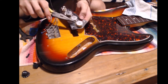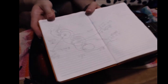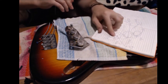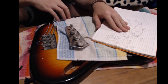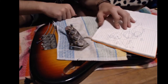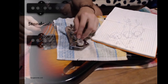Solder those to there, and also we're going to put our ground connections through here as well. Always make sure you have a little wiring diagram when you're doing this stuff while you've got the iron hot. It's good to know what you're doing. So this is just a really rough one I've drawn up. I have links to better ones in the description. I'll probably put up a couple on the screen at some point in this video for you guys to see, but they're easy to find. Just Google jazz bass wiring diagram and you should find it no problem.